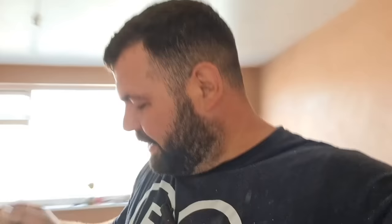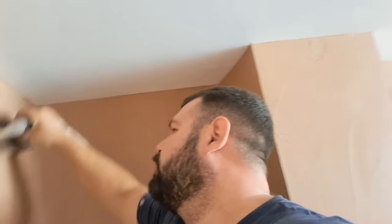Kieran's gone to wash out, so I'm gonna start smoothing all this out now. Now, when you put your trowel on the wall, if it feels like it's not smoothing it very well and it's going to need water, then you know you definitely need to speed up a little bit. So this is just at, say, the borderline.